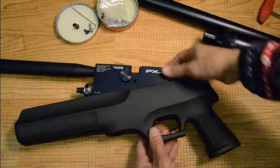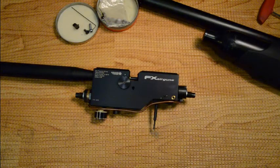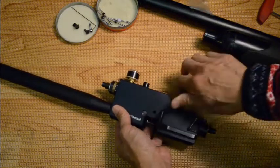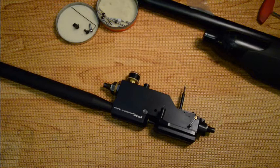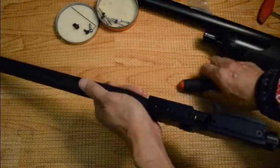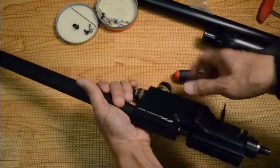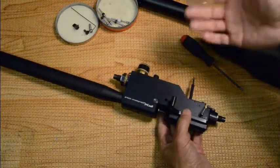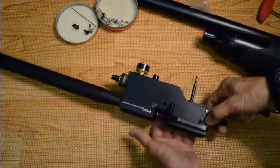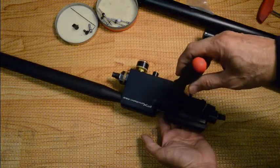It takes about a 1.5mm tool to remove the trigger blade. There is still pressure in there, so what I do is shoot a couple of shots first. You don't want to bleed it too much or there will be less pressure to hold the valve stem closed — you could overpower the spring or disengage the valve stem from its cavity. To minimize damage, I usually stick an Allen wrench in there and manually compress it.